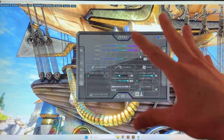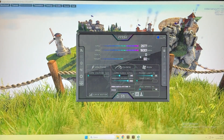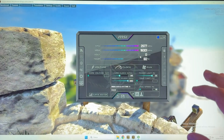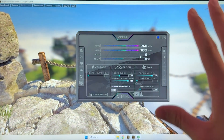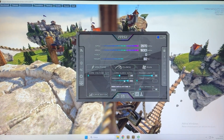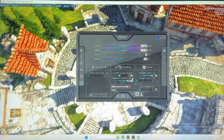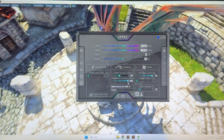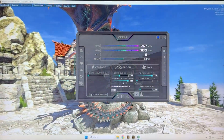However, if you want to stick around I can show you how to get a lot more, because this card is the best overclocker out of the 5000 series so far — and I try a lot of cards before making these videos, so it overclocks really well on average. If you have the beta version, you can fully unlock the memory clock to 3000 and it will pretty much always work. I like to run it at 2000 because I don't want to stress the memory too much, but 3000 is going to work fine.